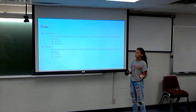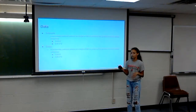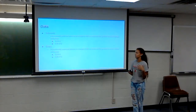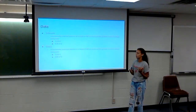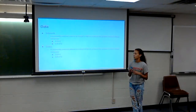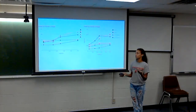For sidewalk and grass, the geometric setting that produced the greatest received voltage and power was the same for both: a horizontally polarized antenna at a height of 160 centimeters, producing a power of 0.15 volts squared. But grass had a greater voltage at 0.34 volts compared to sidewalk at 0.29 volts, which shows that sidewalk had more interference going on.